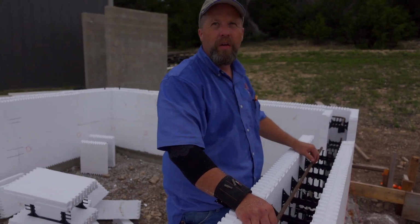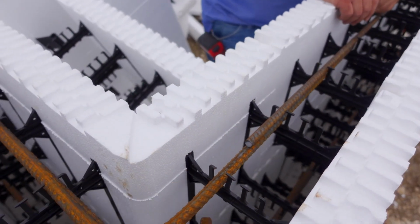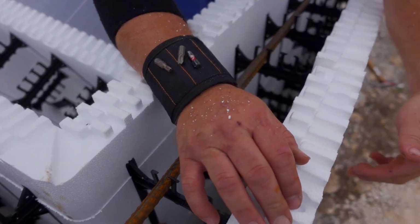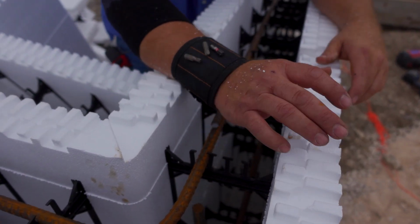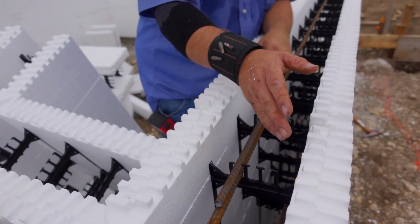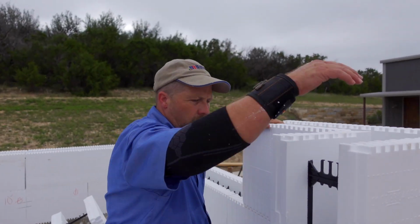Course on the horizontal, because that's what the safe room specs call for. So how far apart are these, one to the next? The web from here to this one is 6 inches apart, and 6 inches apart this way. Okay. The block is 16 inches tall. So that's why I put one at the top of every block, and we alternate these in and out, so that they'll hold the vertical kind of in place where it needs to be. I see.